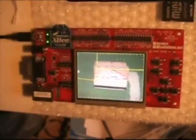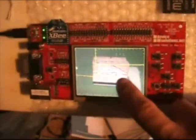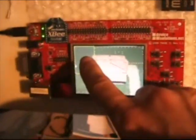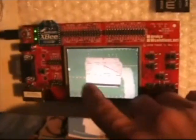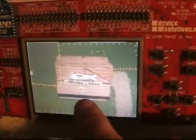The controller for this project is the Tahoe II development board made by Device Solutions, provided by Microsoft. I'm utilizing the touch screen to activate or deactivate the zones. Zones are predefined in this proof of concept, but if the device were commercialized, a desktop or web-based application would be developed to allow the user to either provide a photo of their yard or locate an aerial photo using Live Maps. The user could then draw the zones on the image and save the image and polygon data to an SD card, which the controller would then read.